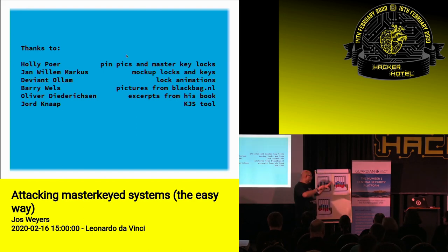So what I mean is... No. The two options are this shear line is your master shear line or not, right? If that's your master shear line, it will be on all locks, because otherwise it's not the master. So that one will never mark again. So if it does mark somewhere, then this wasn't the master shear line. So then I need to file further until I do reach the master shear line. So once I reach it, it's done, it won't mark again.